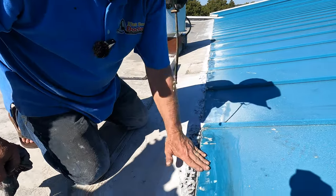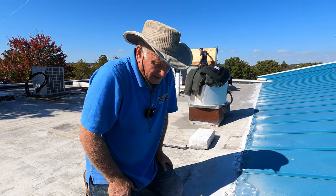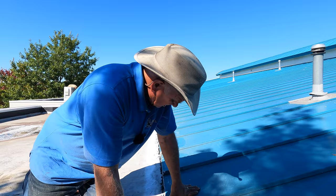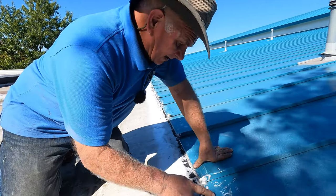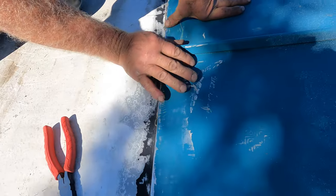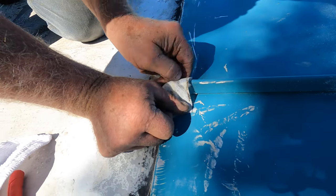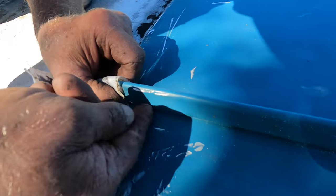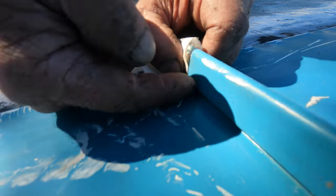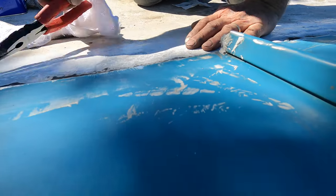The ultimate is to prepare it. I'm going to show you how to make this transition. I cannot bring my transition over this because this is a cap over the two sheets. If you cover this area with a fleece, the water can go in underneath there — do it all the way down — and the water will get into a groove underneath the fleece. If you block this side, water would accumulate there. So you've got to get your fleece right into the corner there.